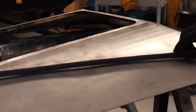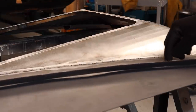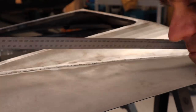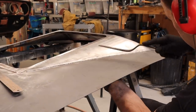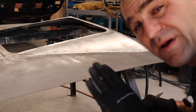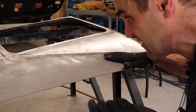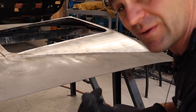Just to give you an idea, this is what the side looks like before I start — look at the gaps underneath the straight edge. You can see how big a low I've got here, there's another low here, there's another low here. So I'm going through and trying to bring that all down so that it's nice and neat and smooth. After a lot of backwards and forwards, I'm actually pretty happy with the results. There is not a lot of light underneath these things — just little bits here and there. It's going to need a tiny skim, but tiny — which is exactly what I was looking for. Now we can get underneath and start doing more of that reinforcing.